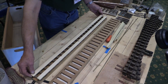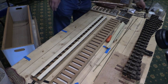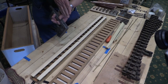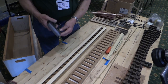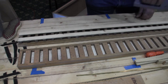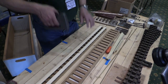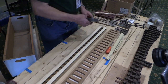same again this side, and then to hold them, mainly while the glue goes off, is a stapler. It's still actually got staples in, but the type like this that will take pins, you know, the nails option. So with nails, you just put a nail in each one. Sometimes they don't go all the way in, you have to just finish them off with a little hammer, because the wood varies in hardness, and sometimes they penetrate all the way and sometimes they don't. So a nail in each one,